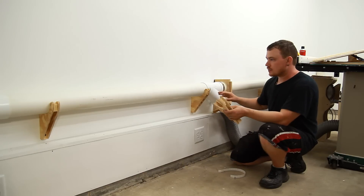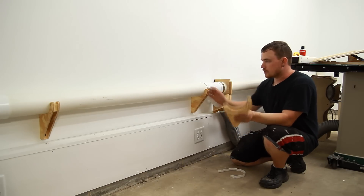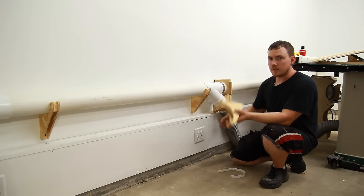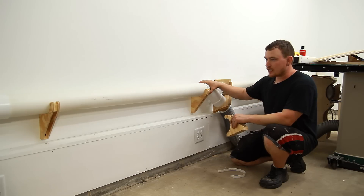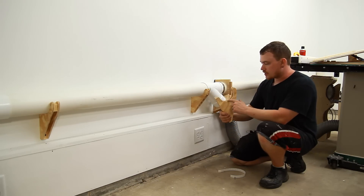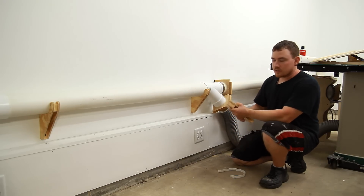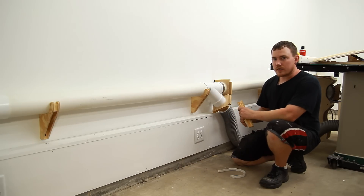Our shops are always changing and tools may relocate, so if I need to modify this all I have to do is just pick up the pipe and cut it and move it where I need to. It's not really clamped down and secured, but it's not going anywhere — the radius of the bracket extends to the halfway point of the pipe so it's really not going to move at all, but it allows the flexibility to be modified down the road. Anyway, thanks for watching folks and have a great day.